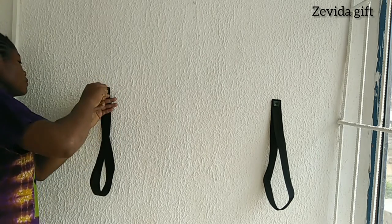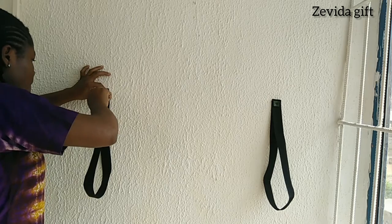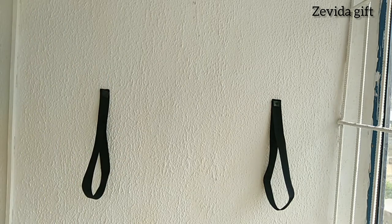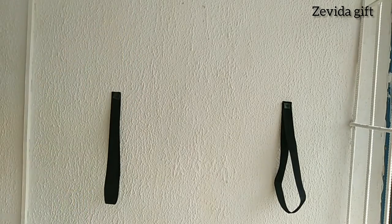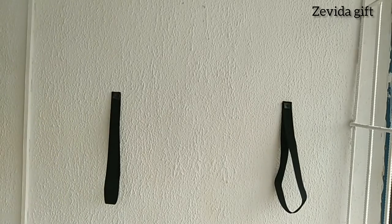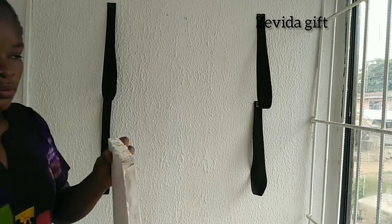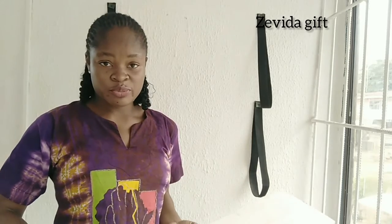Then I use a screwdriver to drill it into the wall. If you're not working with a drilling machine, you have to do this step directly with a nail and a pretty sturdy hammer and hammer it down into the wall. I'm going to repeat that same process — please make sure they align. The distance between this and the next layer of shelf is 14 inches. The belt is 35 inches long while the distance between shelves is 14 inches. You can do three or four layers depending on how many shelves you want.